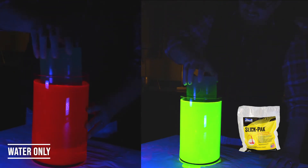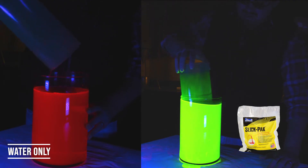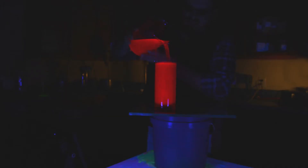The best priming solution is the one that lubricates the pipe and keeps the concrete from plugging up. Next, we want to show you what the inside of your pipe looks like when you're priming. We're going to pour the water into a glass cylinder. Watch carefully as we let the water run out of the glass into a bucket. After all the water is gone, you can see how little material is left behind.